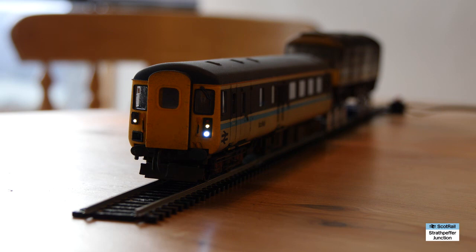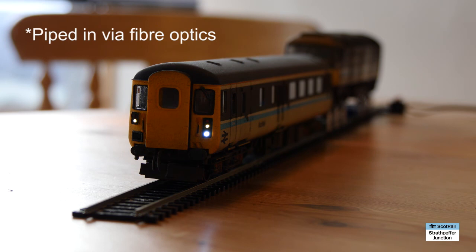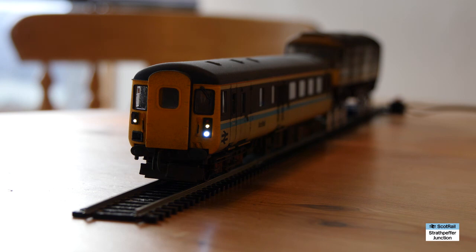For the running lights I used a warm white LED for each, and the headlight was a bright white LED. I used different resistor values — I think around a 10k resistor for the running lights to keep them nice and low, and probably a 1k resistor for the headlight to get the full brightness. Reversing the train, you can get a really good idea of the tail lights, which I think look really good. They're just little tail lights, but they're one of my favourite parts of it. I find it really satisfying that after all the hours, days, and weeks spent pulling together a customised project like this, you get an end result you're happy with and can take enjoyment from.